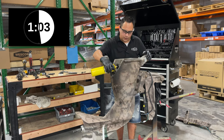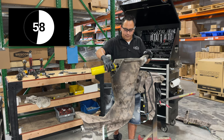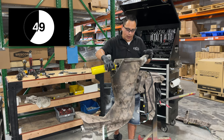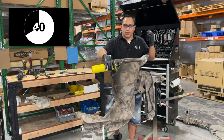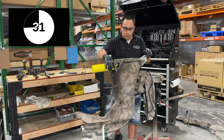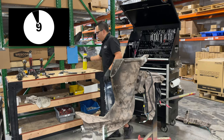I don't know if you can tell from where you're looking, but I already cleaned this up a little bit. There was a lot of dirt, leaves. There was a lot more grease than you can see right now. If you guys have compressors, just blow everything off. Make sure, because we're gonna take this access cover off. So we don't want to open it up and then have all that dirt fall in where the gears and all those bearings are. That will not be good. Should be good for now.